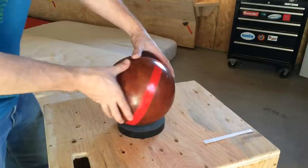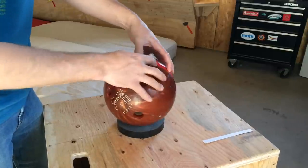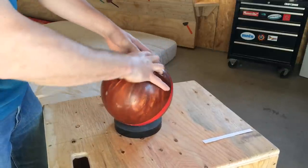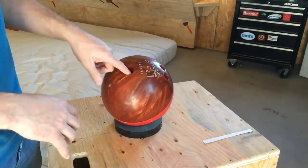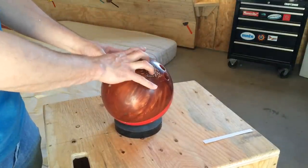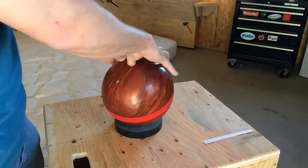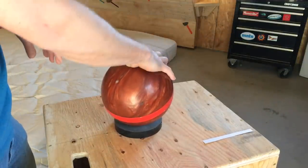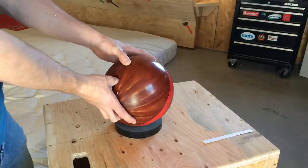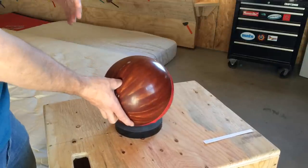I've got some tape where my marking lines were. I'm going to be cutting on the right hand side of this tape — that's where my marks were. One cool thing about putting the bolt in the thumb hole to attach it to the wall is that the pockets won't be centered on the face of the sloper. It'll all pivot around that thumb hole, so you could end up with the pockets on the top of the hold, spin it, you could have some side pull action.